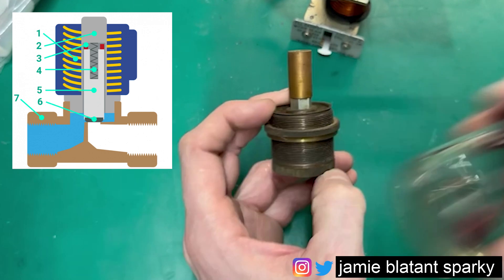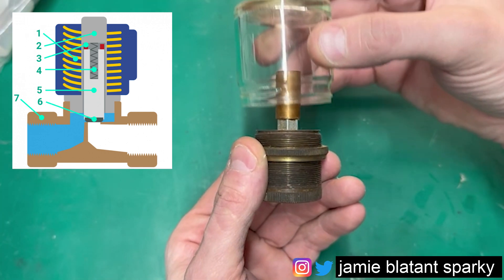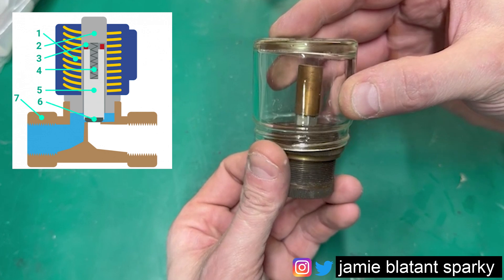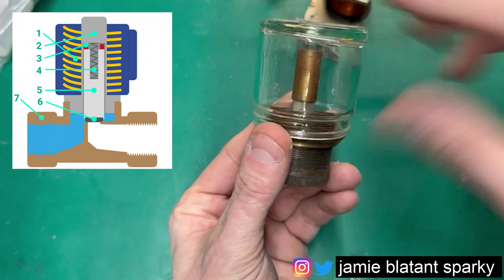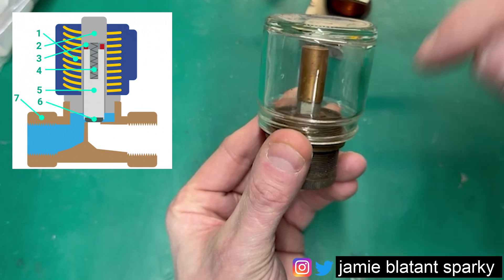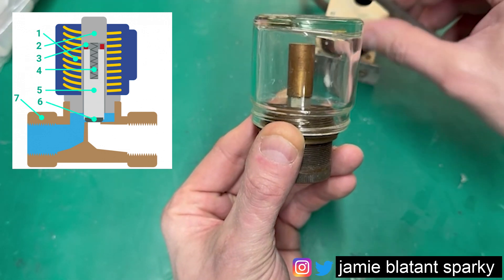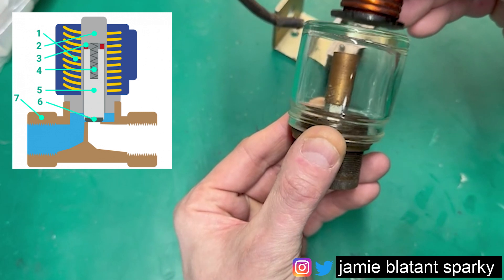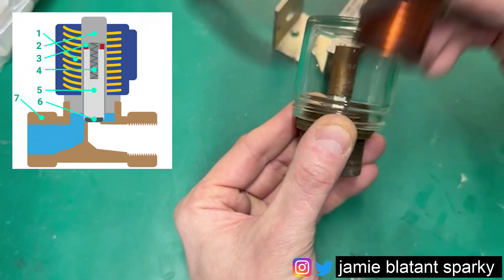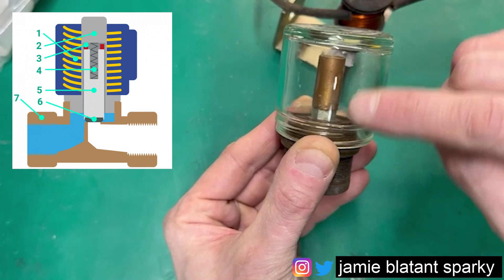It's simple: you put a dome on it. So let's get a dome - you place a dome on it like this. Then because this would be sealed, it's totally sealed - no problem. You can put high pressure in here and the liquid can't get out. But you can't actuate anymore. So what you do is you make your coil bigger so that it goes over the top of this, and then it actuates through a non-ferrous dome. So it'll move that shaft without any pressure leak inside.